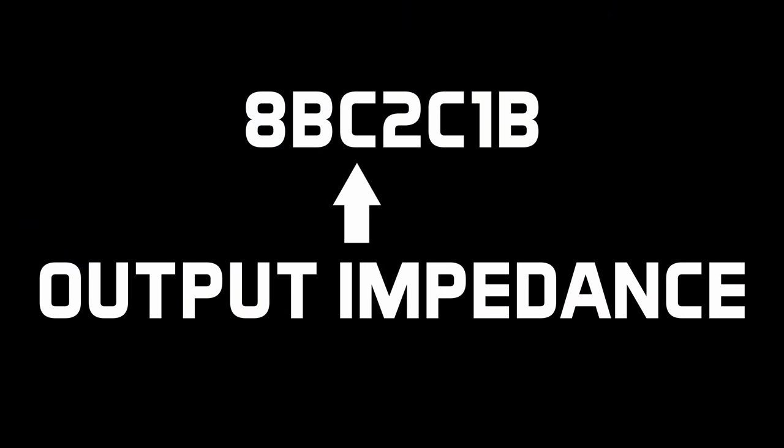The third digit ideally needs to be C to give a high output impedance suitable for being amplified by the instrument input on a standard audio interface, but this isn't so critical if you're using a DI box, as a good one of those will match the output impedance anyway.